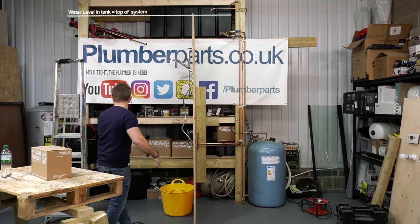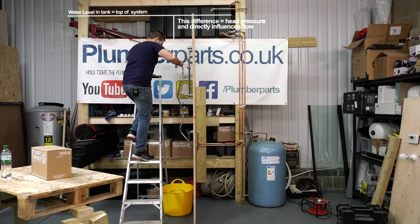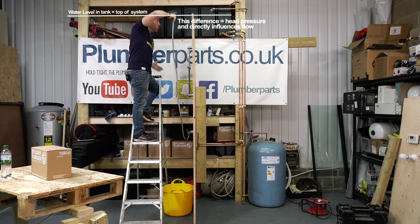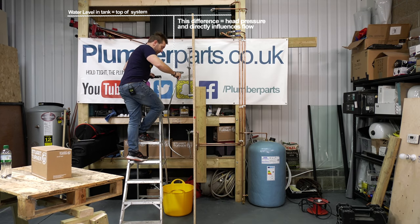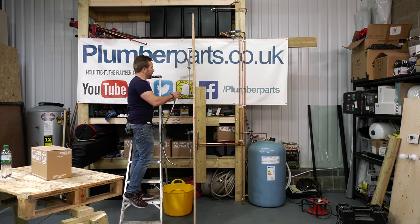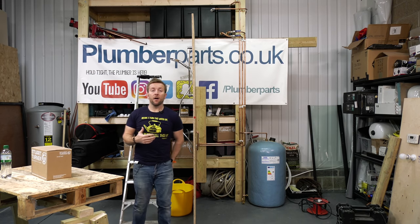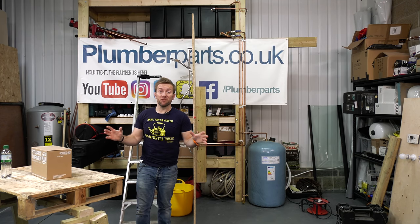The top of this whole system - the top of it is where the water level lies in the top of that tank up there. So if I go further up with the shower head, the flow of water is actually going to get slower and slower until it stops altogether because the shower head is now roughly almost at the same level as this tank up here. And it goes the same way - if we get lower and lower, we're going to find you get even more out - which is why some houses, the ground floor kitchen has got loads of water coming out but the upstairs bathroom is really, really struggling to get any water through.